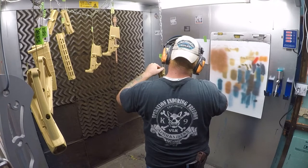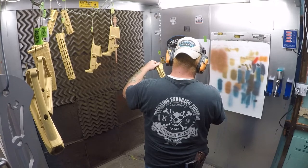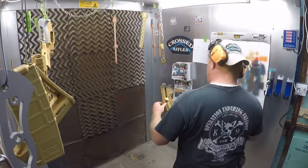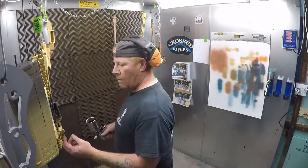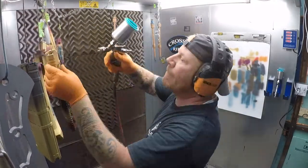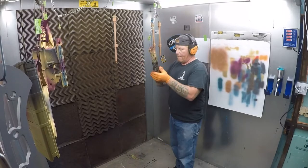Here I'm laying down a stripe of blue titanium — which is our base for the tarnish color — all the way along the bottom of this handguard. I know you can't see it right now because of my back and the terrible camera angle, and I'm going to apologize for that again. Here we land some cobalt accents on one of the jobs, and some black cherry. And here I'm adjusting the gun out and getting that grip, and just like before we're going to go ahead and distress these with steel wool with no tack time in the oven.